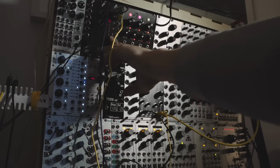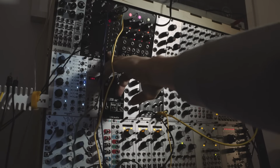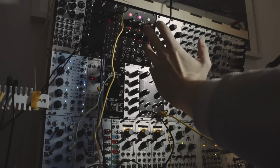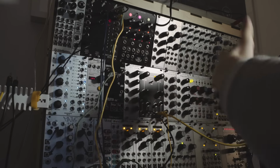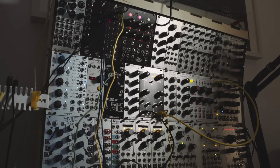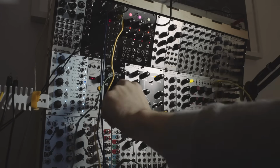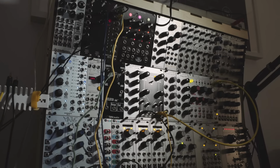You can have obviously lots of different voices. You could have 8 different things. They could be LFOs, they could be envelope generators, they could be sample and hold generators, they could be sequences you've created, they could be pitch voltages, they could be whatever the smeg you want to come out, including audio, which you could be running through the filters, a little bit like we did before.